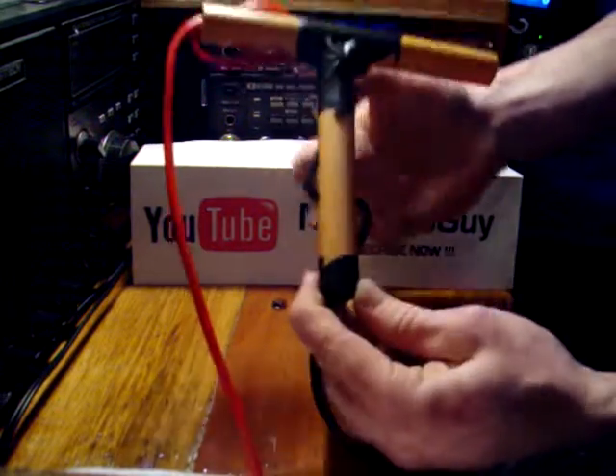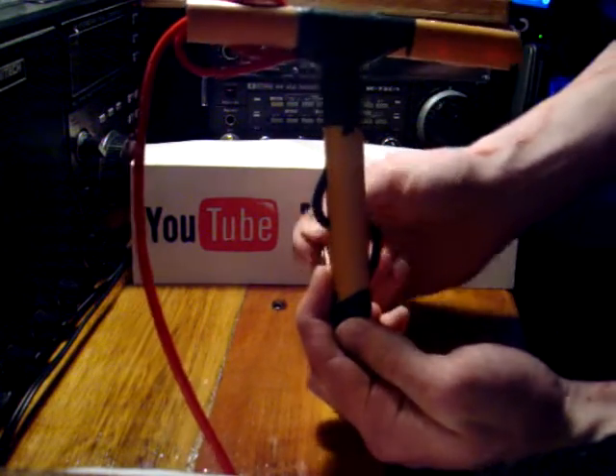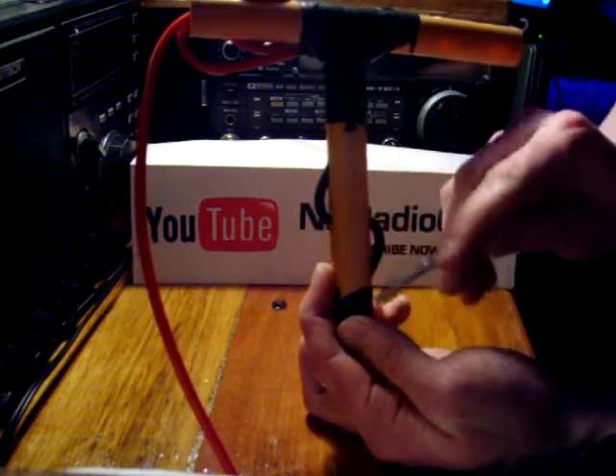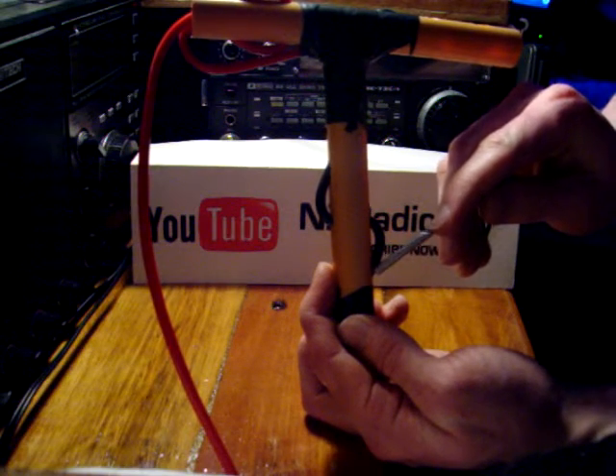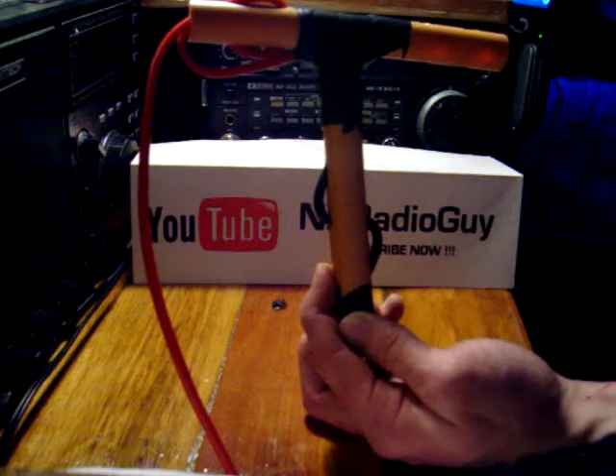The system can also be used for your coax to stop it from getting yanked out and breaking your solder joint. Just the same system: fed up through an angled hole, through a 90 degree bend, back in through an angled hole, and your solder joints are in there.